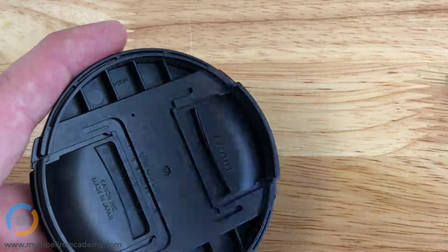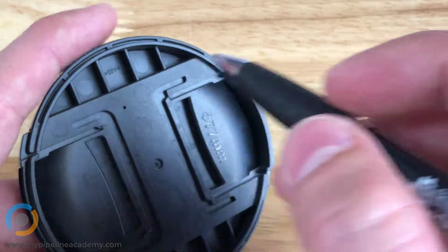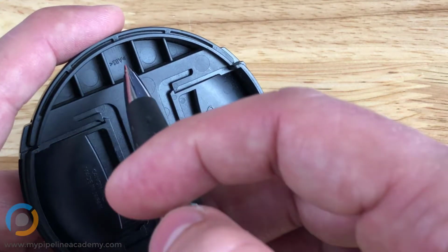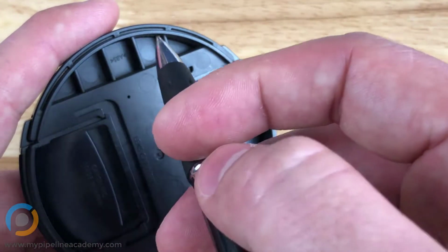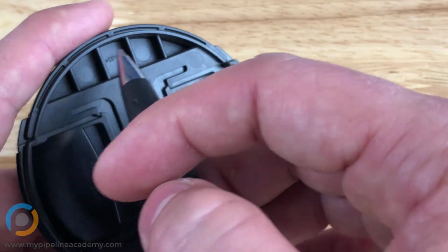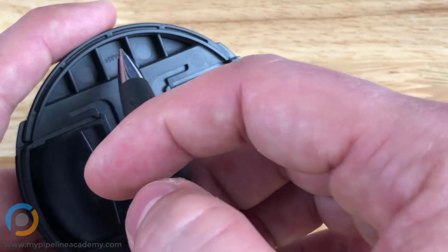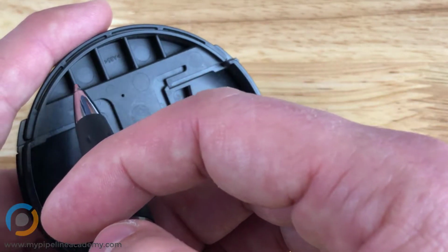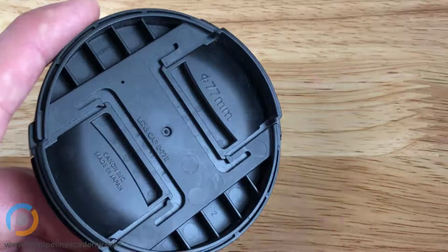Okay. Here are some other great examples of coring and ribs, right? So if this part was machined, you would not have these cores here. It would just be solid material filled in everywhere. But because it's injection molded and you want to maintain a nominal wall thickness everywhere, you have hollow cavities with ribs interspersed between to provide some more structural stability, some more rigidity and strength to the part.